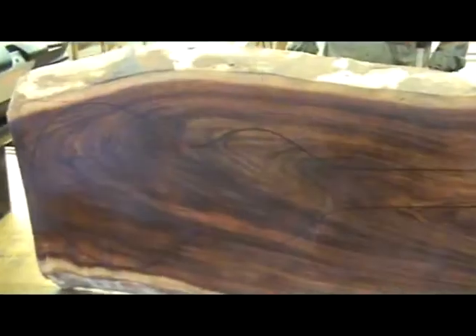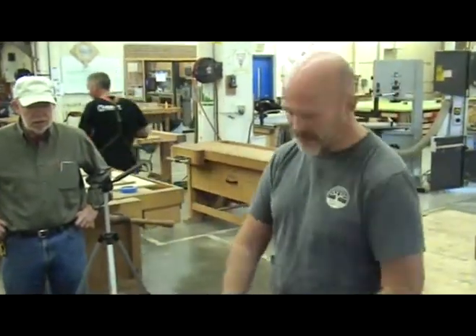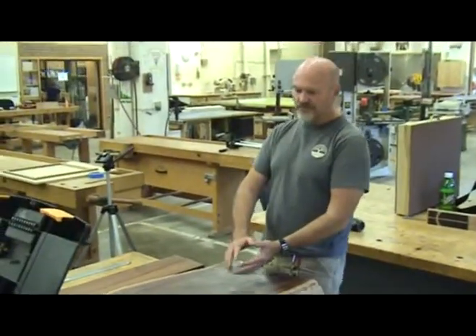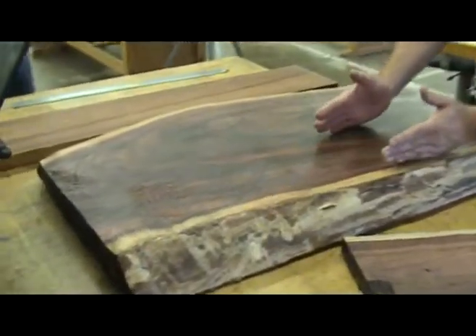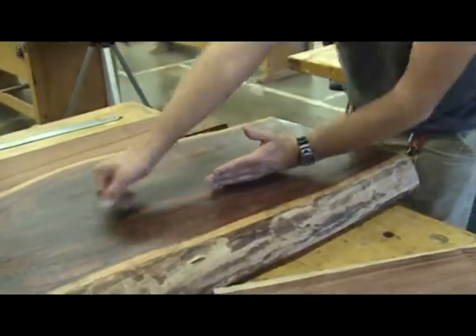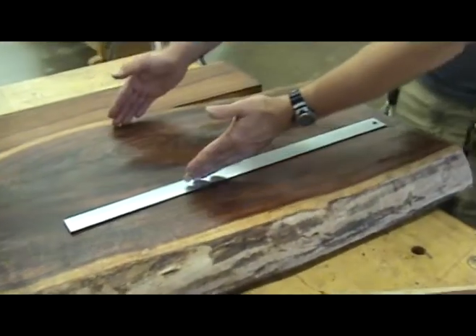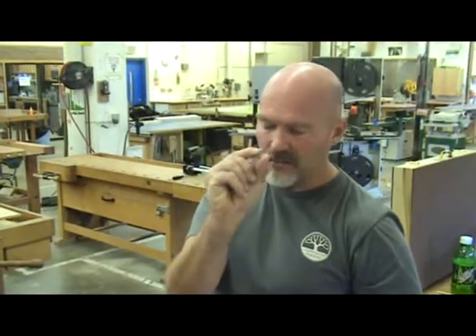There's a lot of work to set up your saw, but for maximum yield resawing it is imperative that setup be done first. So let's do some resawing. We have a piece of koa here that's been in the United States for less than three years. If I were to start resawing it right away, as soon as I make my first cut, I'm going to encounter moisture, compression wood, and tension wood that's going to cause this wood to react badly. My goal is to get as many thin pieces out of this as I can. Our strategy is to cut a slab that's about guitar-side size, leaving a larger piece that's about half the size of a guitar back. If I started resawing them into thin cuts for guitar sides or backs right now, I'd end up with a curled mess of wood because as soon as I open this log up, it's going to react.